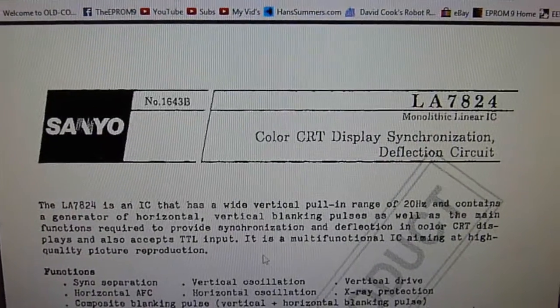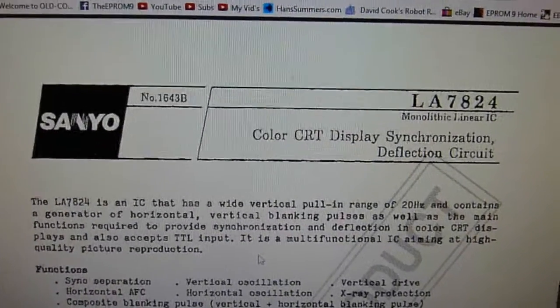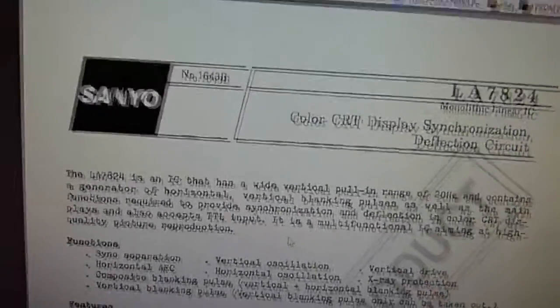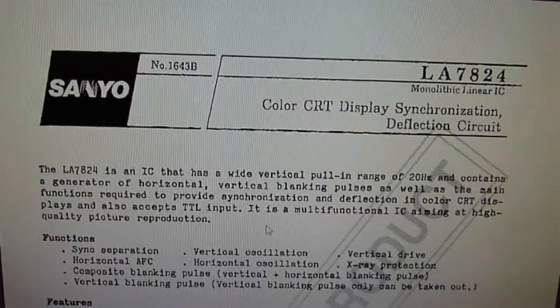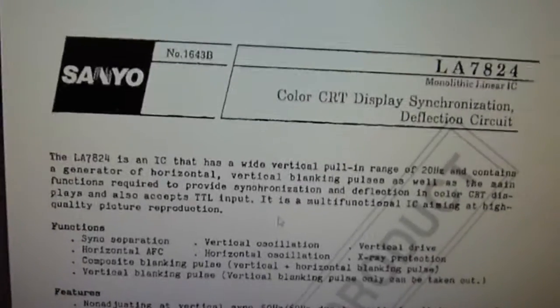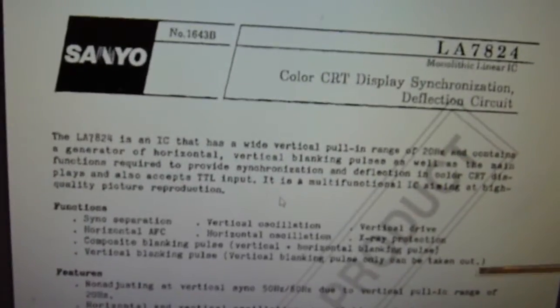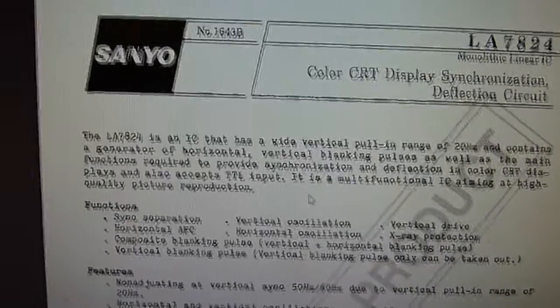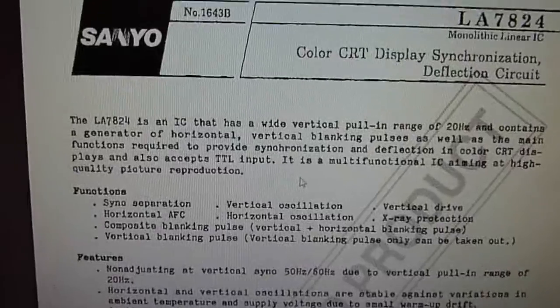Well, I was completely wrong. In fact, it's to do with the CRT timing for the electron beam scanning. You know, it controls things like the blanking and whatnot. That was an interesting find, bearing in mind there's no CRT inside this device.